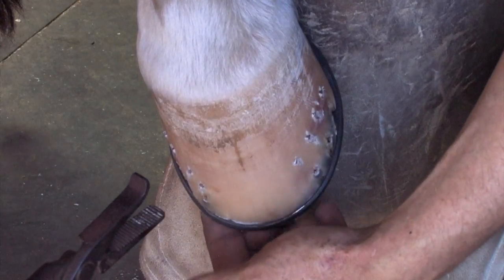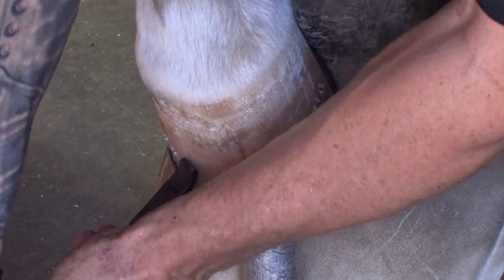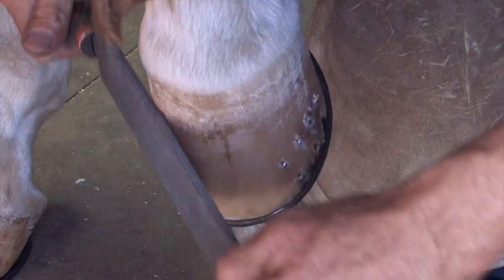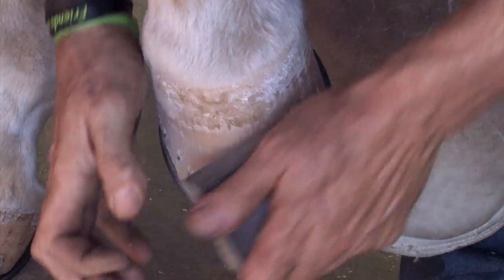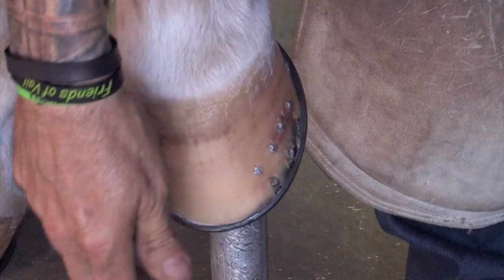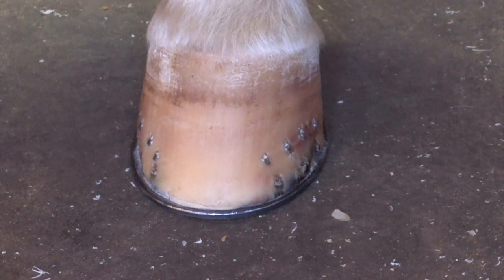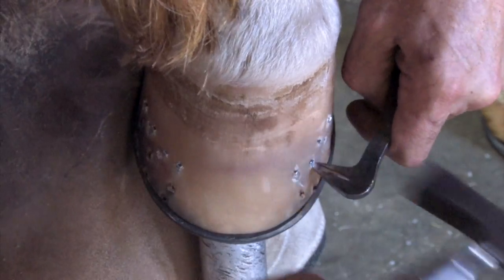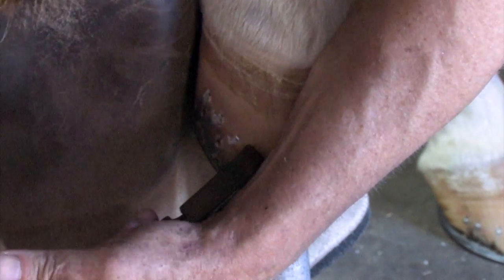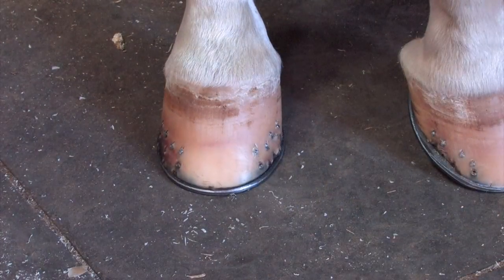These are a small nail — they're a 4.5 race. You don't have to squeeze really hard. Just bend, pull back into the foot. Bend over, pull back into the foot. And there's our finished product. Gouge a little bit of hoof wall out from underneath the nail where you want the clench to sit. Now we're finished with the foot — we got it clenched.